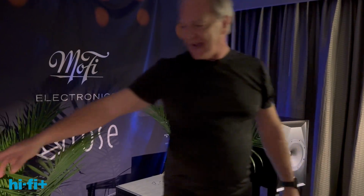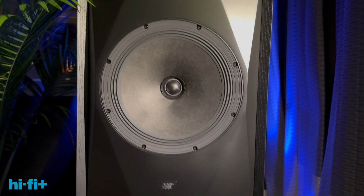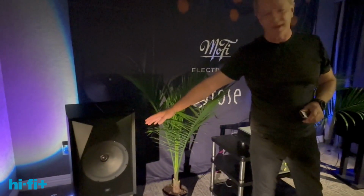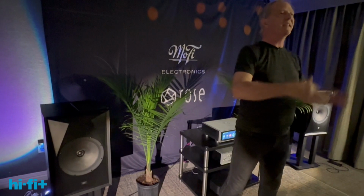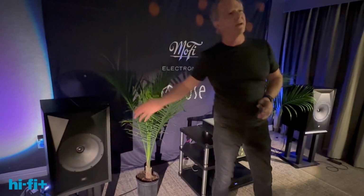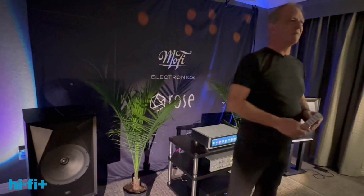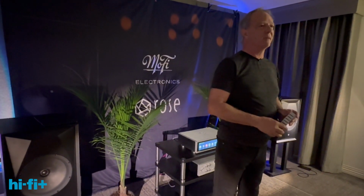The only difference there is, because of the mid-century modern vibe, I've added the picture frame around the edge of the cabinet. Now, normally on a flat baffle, putting a picture frame coming forward would really mess up the diffraction, but because it's now behind the plane of the baffle, it doesn't have too much effect. There's a modest effect, but not disastrous.